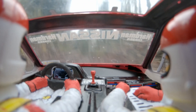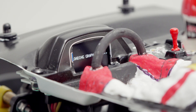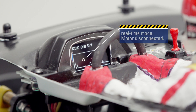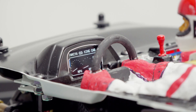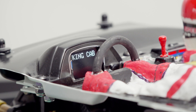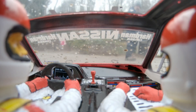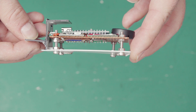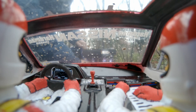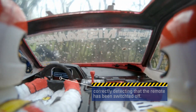From the software side, I said I need more than just some speed gauges. The driver can now choose to see a graph display of power and voltage on the car, and after coming back from a race he can also switch to a history view with his last ride animated across the small screen. All this is triggered by the remote control, but I have some problems with erratic switches of modes — it could be cabling or cold solder joints, it's hard to pinpoint. I've tried to code in some fail-safe logic so a loss of signal does not directly impact the system, but I haven't found a solution yet.